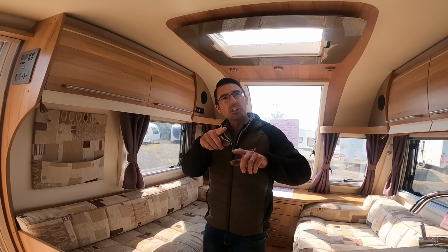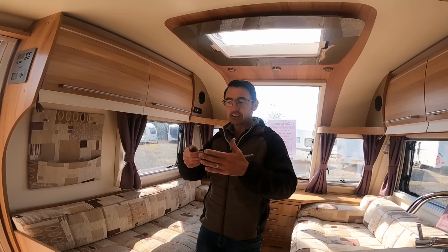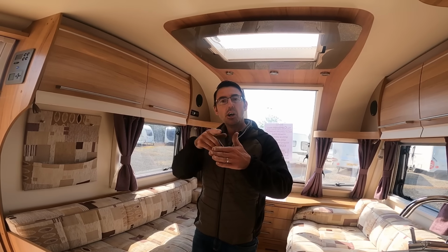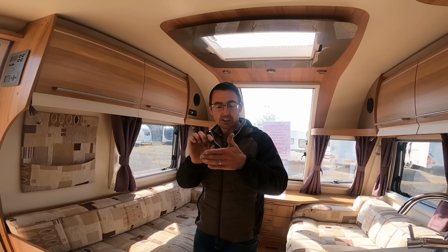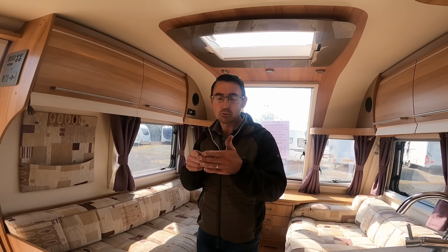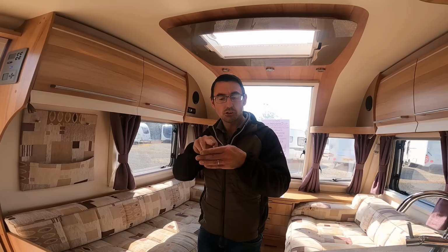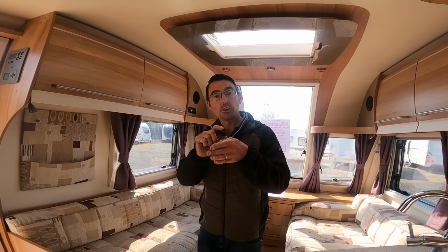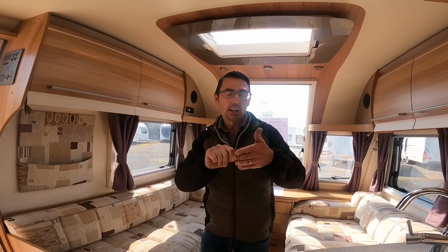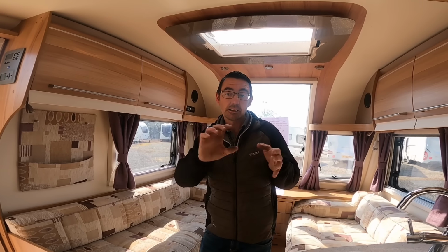So you'll see on that video that I hadn't got a proper tool, you can buy a proper tool to push the wires onto those connections properly, and they're not that expensive, to be honest with you, but I hadn't got it with me, so I just used a flat-headed screwdriver and pushed the wires onto the little connector. It's literally push them in, make sure that they're making a good contact, click the back and it locks it all in place, and it's a brand new plug.